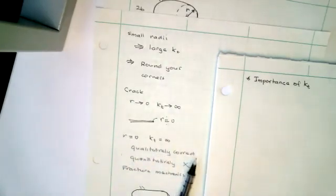When we started off talking together, I showed you a Briggs and Stratton crankshaft, and I've seen two others exactly the same, where the fatigue was initiated right where the stress concentration was with all three of those crankshafts. So there's no disagreement between myself and the book on the issue of fatigue. And if the part of the section written in the book that I'm going to discuss next was correct, and there was no fatigue, there'd be no reason for us to consider stress concentration. But I'm going to discuss a couple of things about this. The book is a good book, but it doesn't get this right.